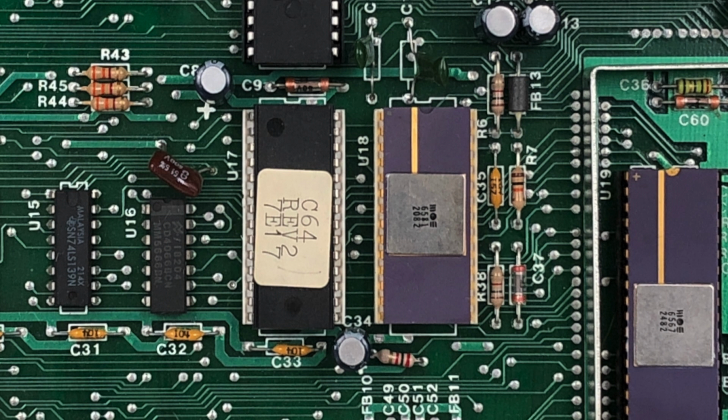The 82S100 was invented at Signetics in 1975, and it was the first field programmable logic array to hit the market. Bob Yannes at Commodore wrote the logic equations for the C64 PLA. It's said that these Rev2 7E17 PLAs contain additional logic equations that aren't present in later PLA revisions, but that they are disabled. Functionally, they're the same as later revision PLAs. 7E17 is assumed to be the checksum of the JEDEC file used to program the 82S100.